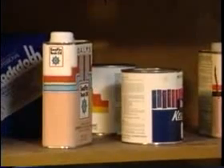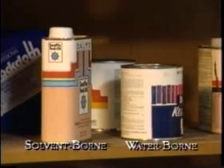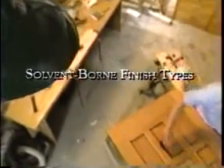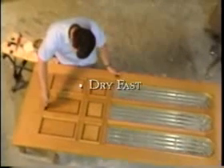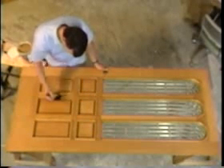The top coat you'll use as your door's clear finish will be one of two types: solvent-borne or water-borne. To pick a finish, consider the needs of your specific application, then evaluate the relative characteristics of each type. Solvent-borne clear finishes include oil base, alkyde resin base, and polyurethane resin base finishes. All have several distinct benefits: they dry fast, they have a hard finish, and they're very water resistant. You can also apply solvent-borne finishes under variable weather conditions, including cooler temperatures.